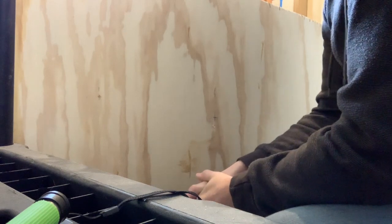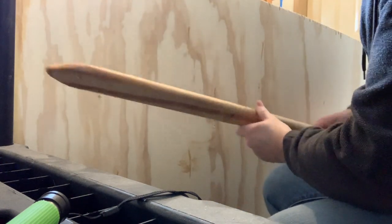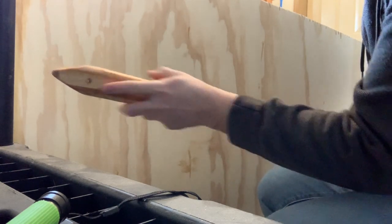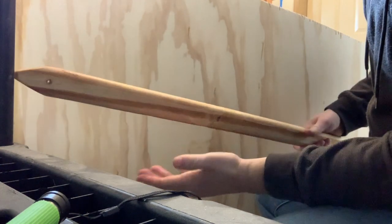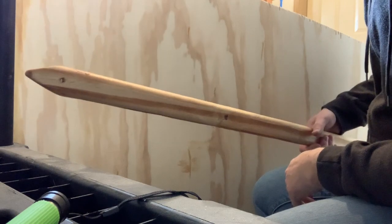Back to doing the same thing I was doing yesterday morning. I changed plans a little bit yet again — I was going to do the gunnel molding on this side first, but since I'm all set up to get back to work on the rub rail on this side, you may recall the board snapped when I went to lightly tap the carriage bolt into this hole. Here's the board — this is the resin joint right here — and the board is soaking wet, should be more pliable. I'm gonna give it a try. If it breaks again, it breaks again — not the end of the world. I'll get this front bolt put in first and then try that second one again.